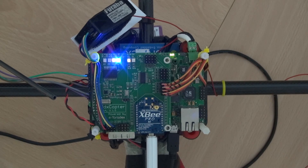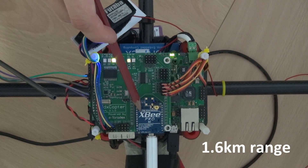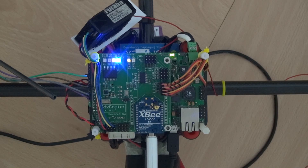This gives much higher resolution than the stock PWM controller on the Toradex board — there we have 250 steps, here we have 4000. This blue thing is the XBee controller for communication between the quadcopter and our computer. The white thing here is just a WLAN USB stick so we can program it wirelessly, because programming works very well over WLAN.